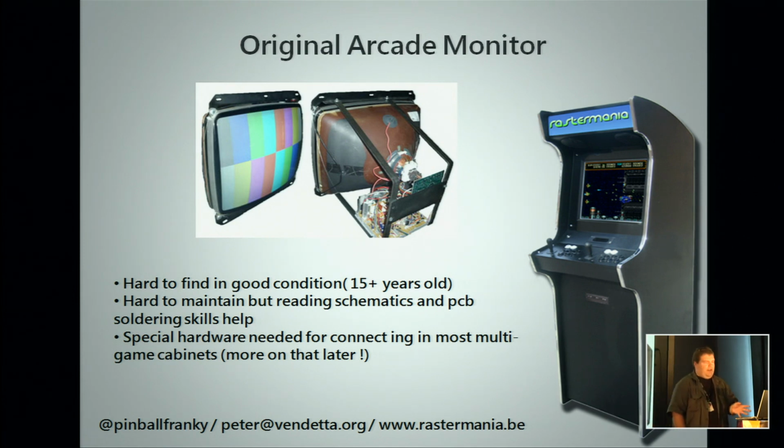Good thing is, recently the Chinese aftermarket has started making new chassis, the PCBs, which actually control the monitor. You can now buy them for about $80-$90 plus shipping. You have a new chassis, and if your tube, your glass, is still okay, don't forget that holds your electron guns, which actually create the picture, you could still revive a screen in a limited fashion.